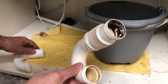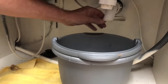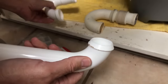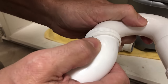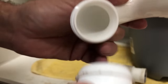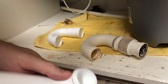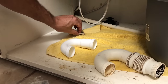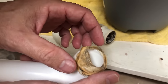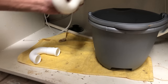Here's the trap we took off. This is called a wall tube. The wall tube that came with the new P-trap is the same as this one — you can see how it just goes inside, kind of loose. But on the correct fitting there's a mated surface for the bevel to seal against. This bevel mates against this bevel and seals it — they didn't have that on here. So what they did, they wrapped Teflon tape around there and essentially blocked at least half, probably more, of the flow. So when that dishwasher pump came on, there was no way for the water to get through. We put it back together without that and it's draining fine.